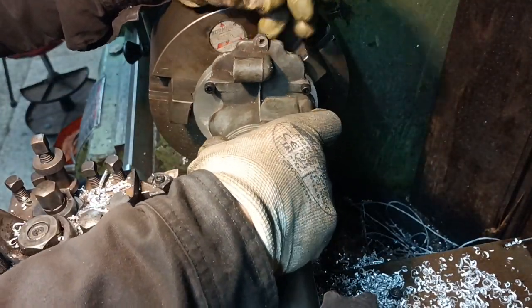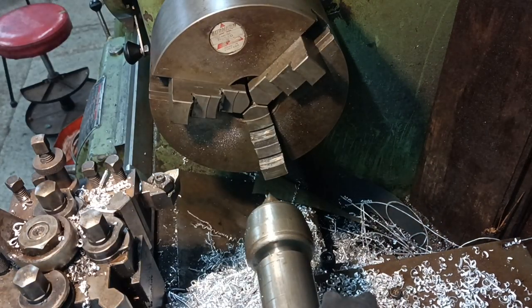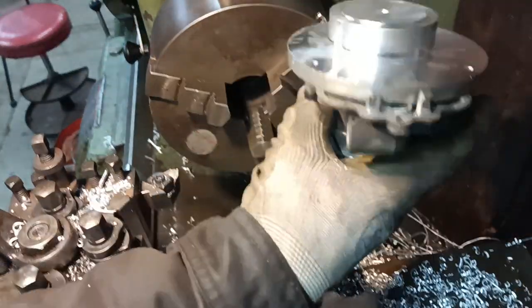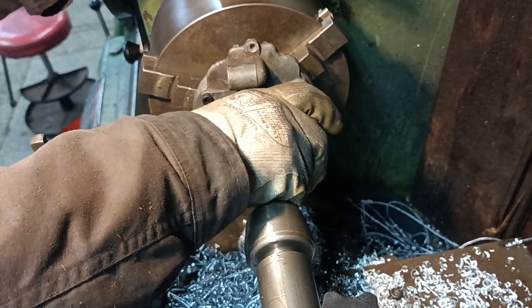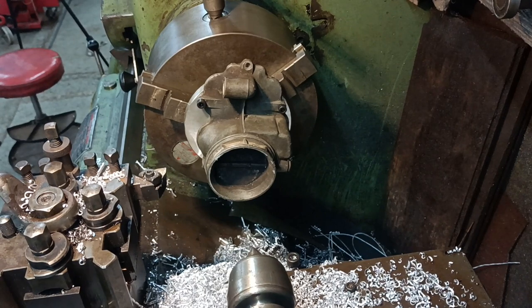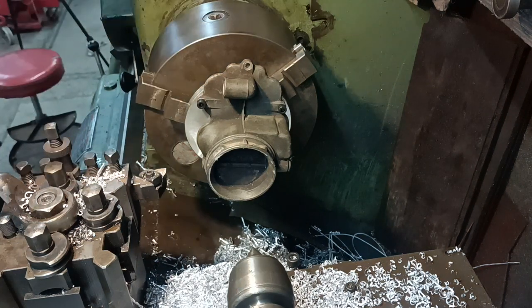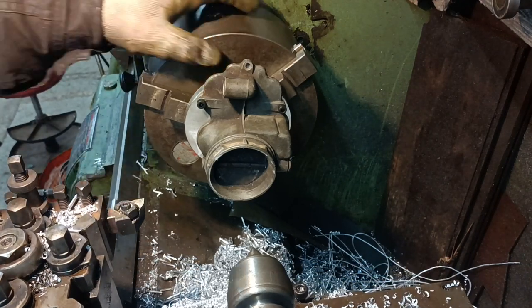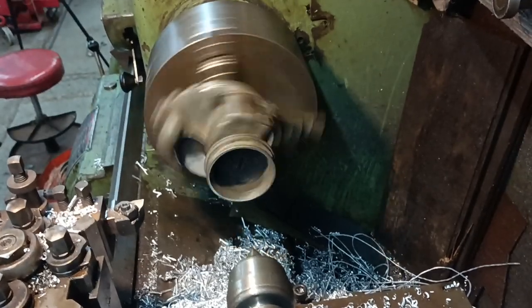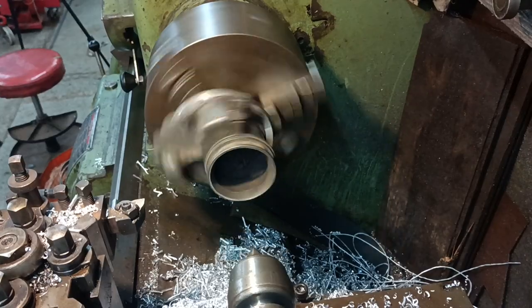So the idea is that will chuck in the chuck jaws, not these chuck jaws, but that will chuck in the chuck jaws and stick out. So let's get the other chuck jaws in. So we're going to chuck on there now. Which it does nicely. So let's just see, because this one's a bit damaged now, but it's damaged anyway, it's scrap, which is bloody annoying. Get this out of the way, don't want another accident. Okay. So you can see from that that I'll be able to put another carb top on and just skim it. Good, isn't it?